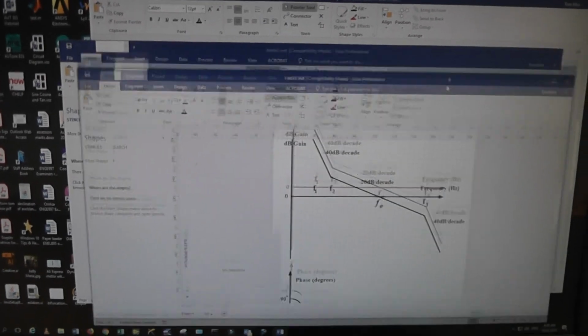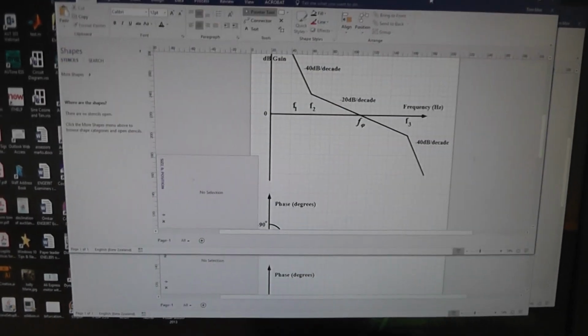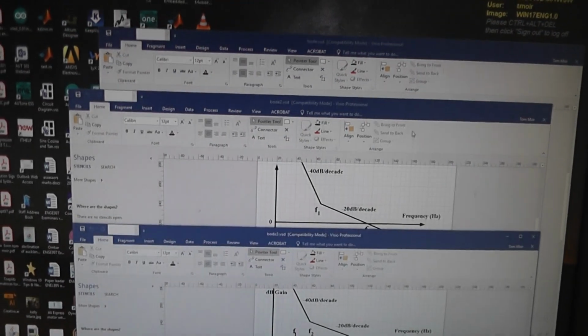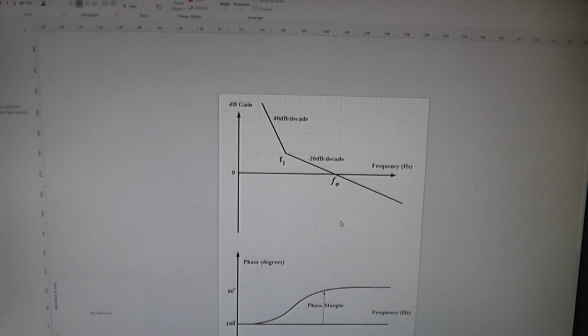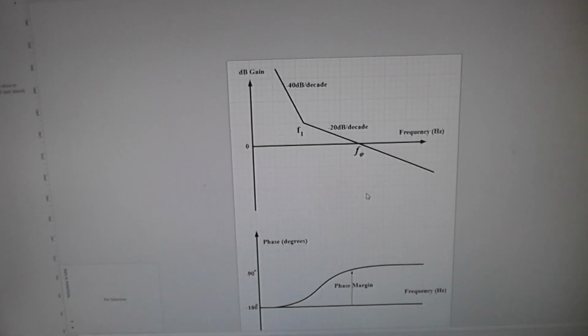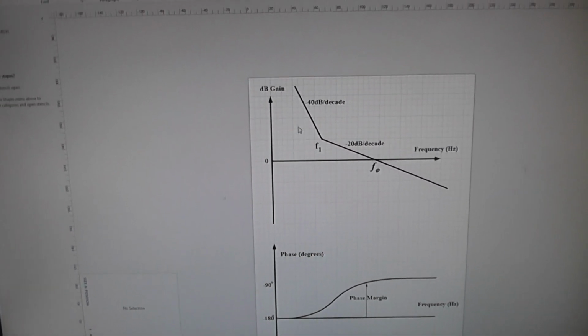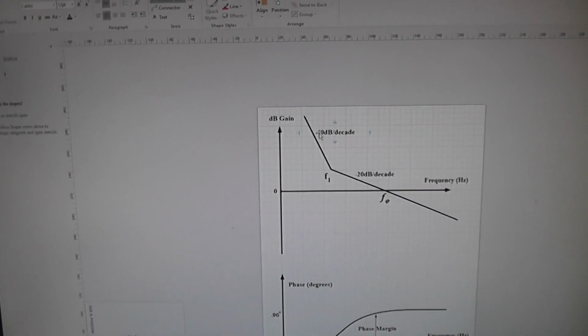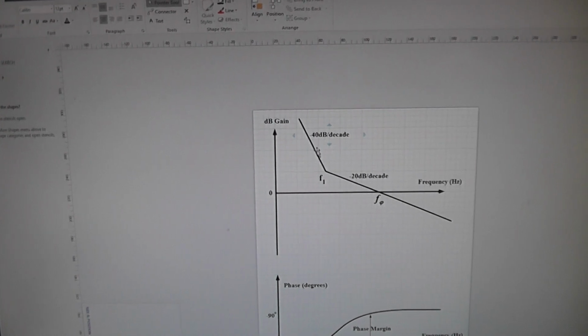Then what we can do is probably the ultimate, not that one. This one here is nearly the ultimate. Put two integrators down at low frequencies. There's already one there. Put a second one in, and then you get this really steep slope, -40 dB per decade.